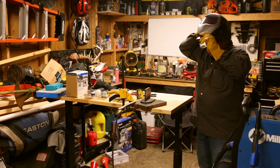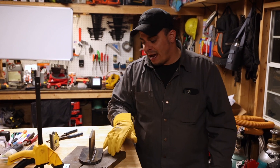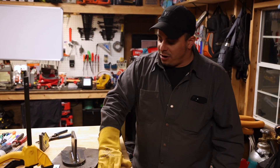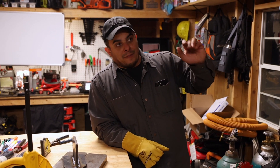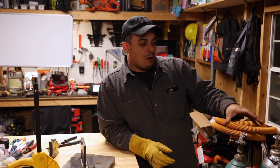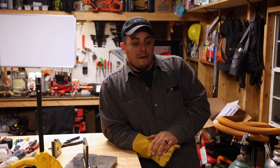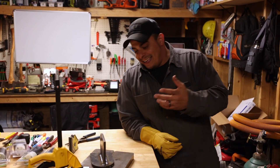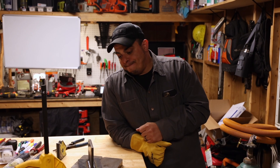Alright friends, I'm pretty happy as a clam right now. Welds look good — a little bit of undercutting because I cranked it up just to burn down into it and the steel was pretty cold, but other than that, pretty good welds. It's going to run this welder by itself without a problem. It couldn't hold the heater and the welder at the same time, which is expected — it's not made to do that, and the heater's pulling a constant draw along with the welder. I'm pretty impressed with this generator so far, we got clean power. We'll do more tests in the future, mess around with the RV, show some adapters, use the whiteboard. Thanks so much for watching and being part of my channel — see you in the next Pixel.